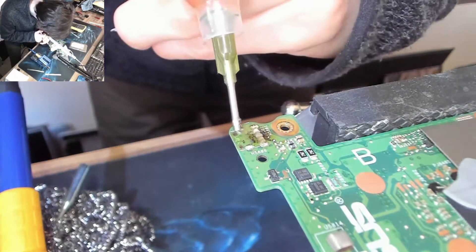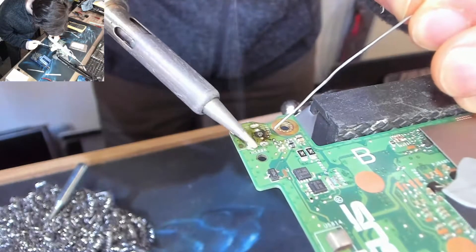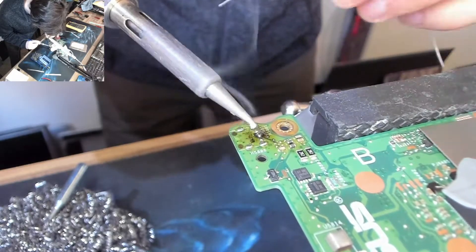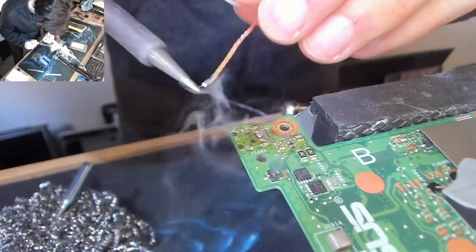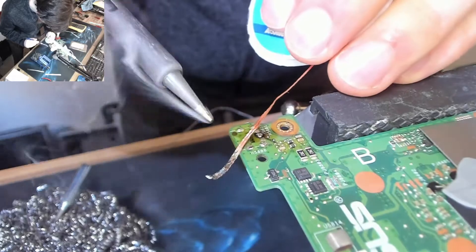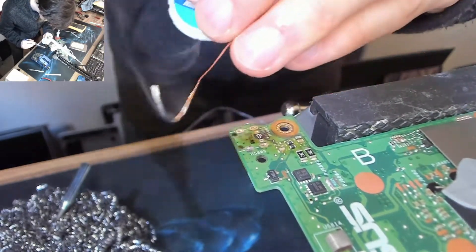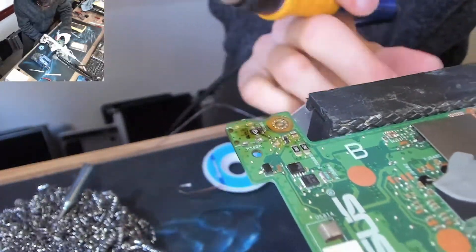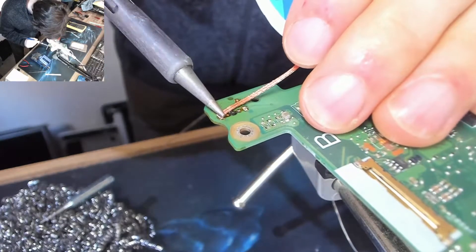The old jack is off and I'm going to try and clean up the board. First I'm going to put on some fresh solder just to mix into the nasty lead-free stuff and generally clean up the area, then wick it all away to clean the gunk off and clear the holes. Unfortunately the anchor holes are really small so despite a lot of effort I wasn't able to clear them. However, because I'm using hot air to change this jack, that's not the end of the world — we can just melt the solder as the new jack goes in.